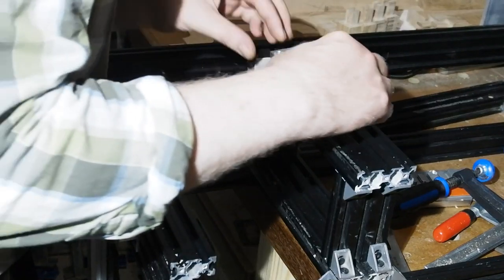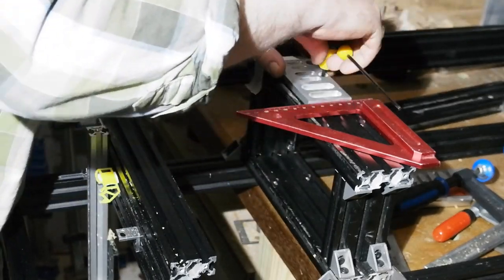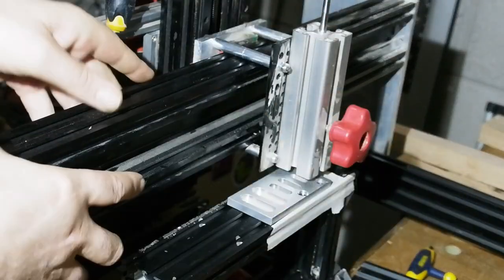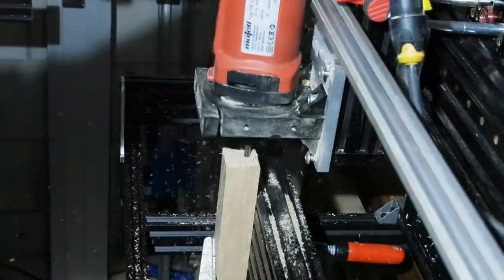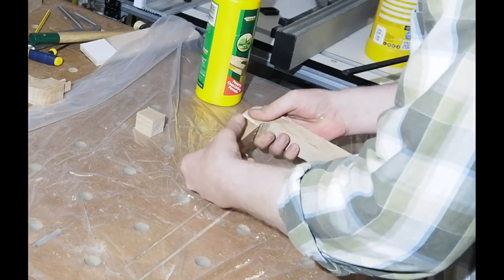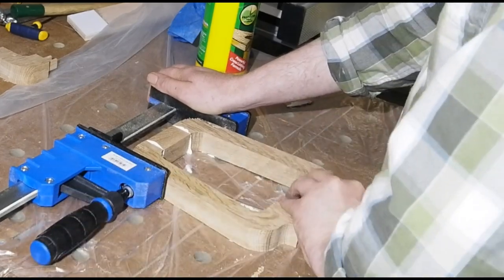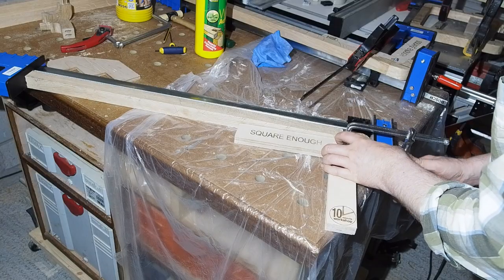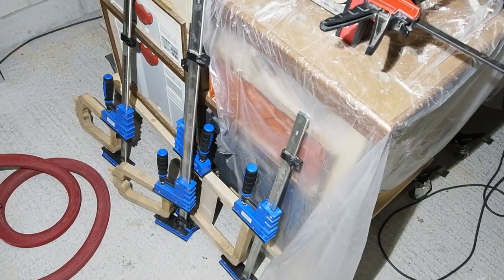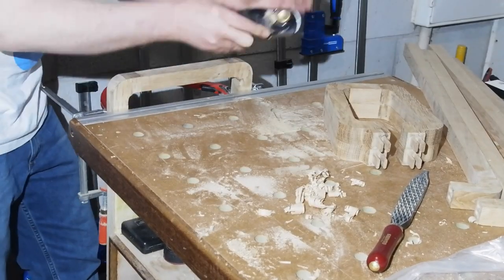At the back of the gantry you can see the copy pin that follows the templates. Everything milled — 42 mortise and tenons in all — time to start assembly. Despite the angle and curves on these speaker mount pieces, a little block appropriately sized at the bottom makes for easy clamping. With other pieces, using clamping squares and shims keeps everything behaving well between clamp jaws. Out of the clamps, a little fettling here and there takes off the odd tenth where pieces meet.